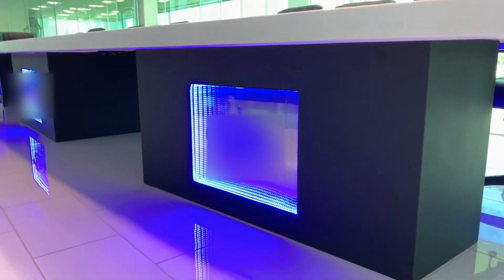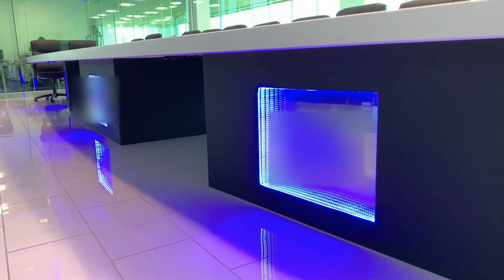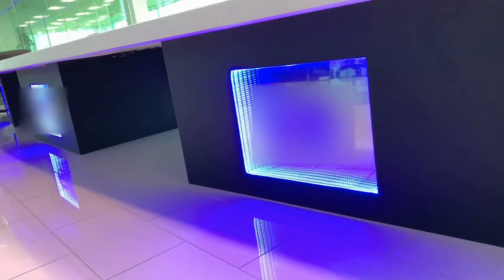Here we got an eighth inch of our plexiglass, and then we've got 3/8 LED, which comes out to the half inch plywood that was used there. So the LED ends up flush, and then we put our frame right up against it, like you can see right there. Once you screw it in, the mirror will not come out, so the hot glue is just to hold it in. And here is our finished product. As you can see, it's very beautiful. I'm really pleased with it.